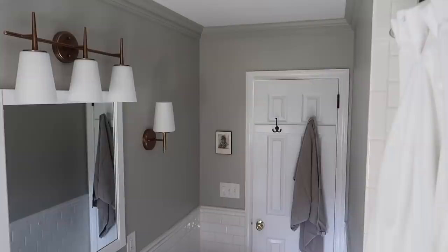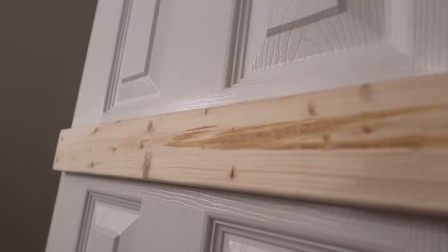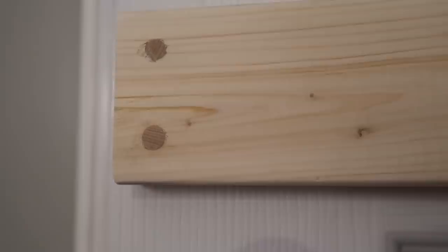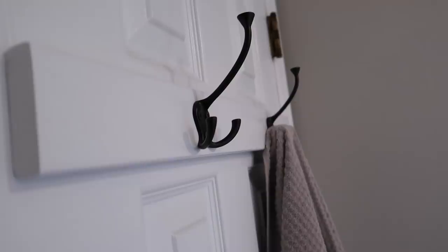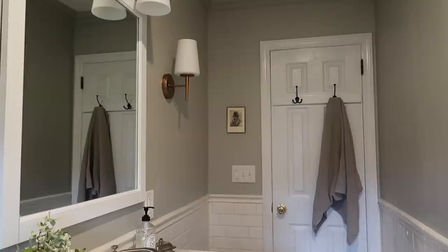The second project we tackled together was to fix the hooks on the back of the main door. We had hung two black hooks when we first renovated the bathroom, and one had fallen off. The other was still up three years later, and we never got around to putting the second hook back up because we wanted to reinforce where it was screwed in. So we took down the other hook, found a piece of wood we already had on hand, and made it as wide as the door — because our doors are hollow core, the main support is on the edges. He sunk the screws so we could use wood filler and make it look completely smooth so you didn't see the screws at all. After it was up, we sanded it, painted it to match the door, and put the hooks back onto the wood.